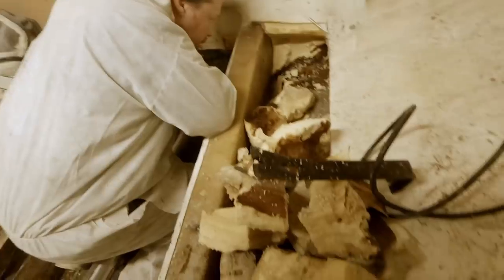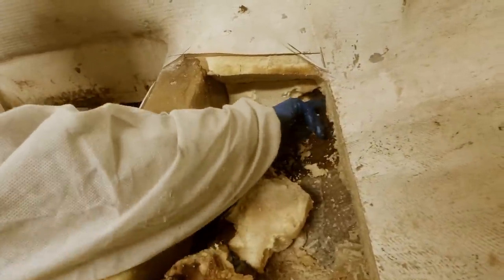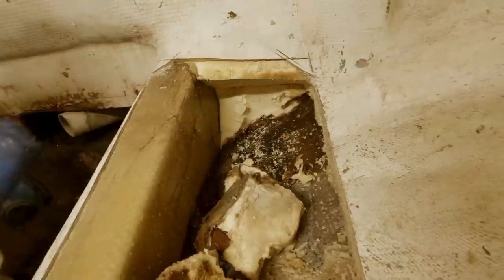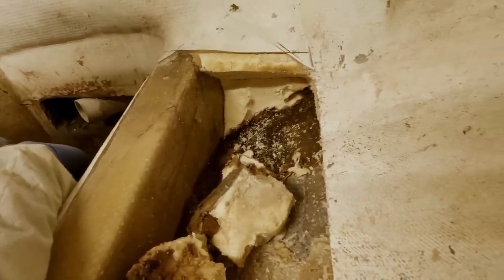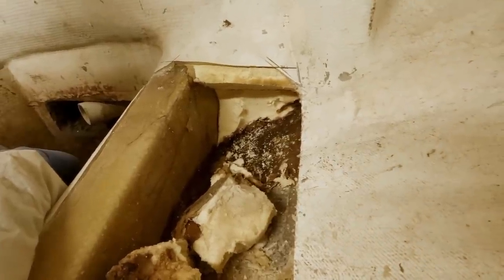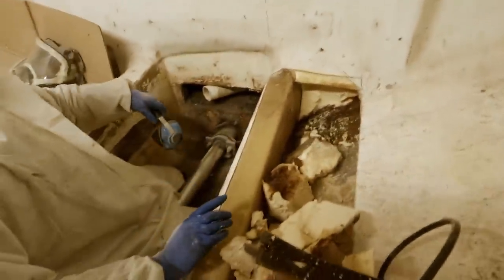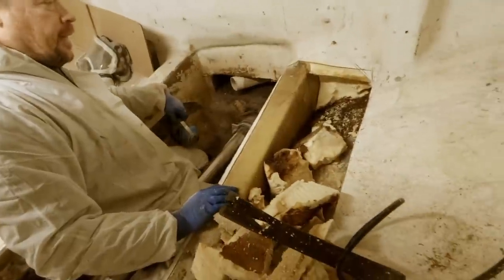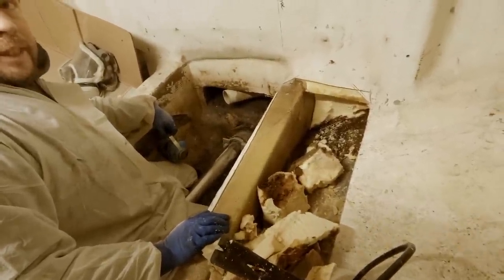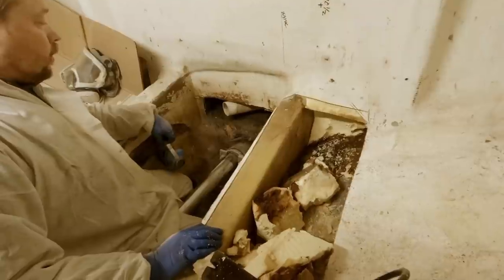Wow, a lot of water was coming down from right there. You can see it's kind of eroded, or maybe that was just a pocket, but you can see water has been coming down through there, picking up some rust somewhere too. It's probably from before we reglassed the deck joint. I could see water running down the inside of it. That's what led us to suspect the deck joint. There's not a whole lot of places the water could have been coming from, so it was our most obvious culprit. We haven't had any more issues with it coming down the wall, where we have the foam cut away for this bulkhead. So we should be in pretty good shape there.